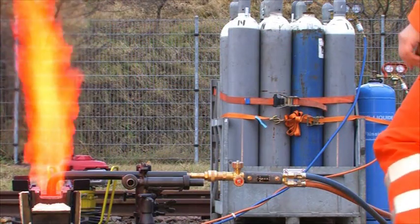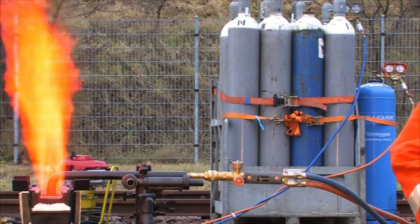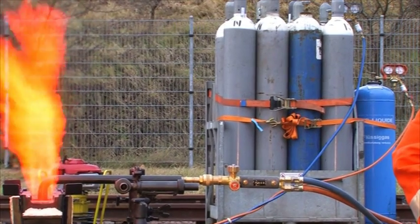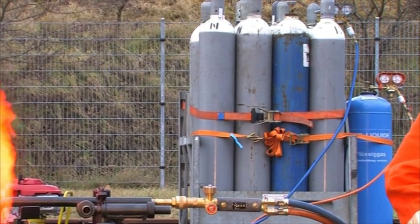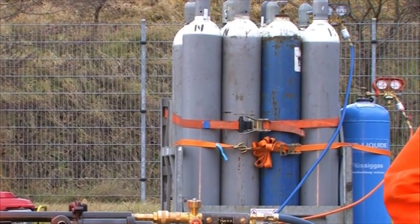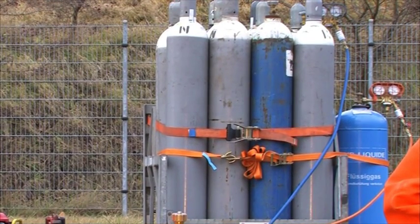At site, the gas is extracted from cylinders. When the gas extraction takes longer, then the cylinder pressure decreases. In consequence of the working principle of the reductor, the working pressure inside the hose likely increases. Thus, the working pressures shall be kept constant during the whole preheating by regulating the reductors to avoid any subtle uprising of oxygen excess in the preheating flame.